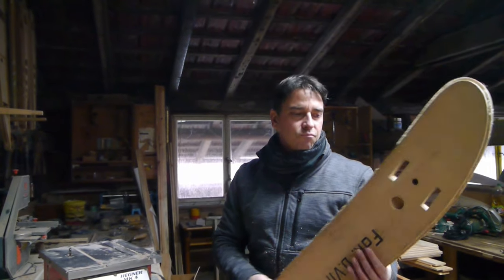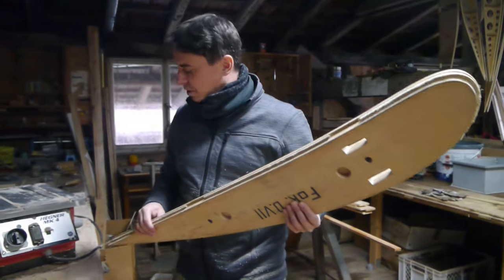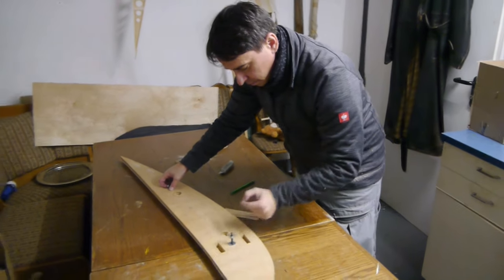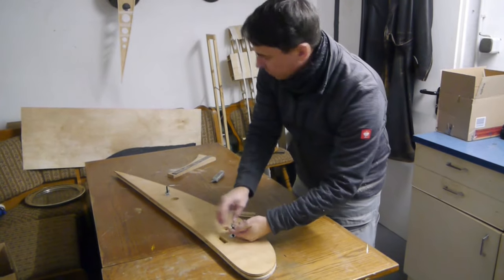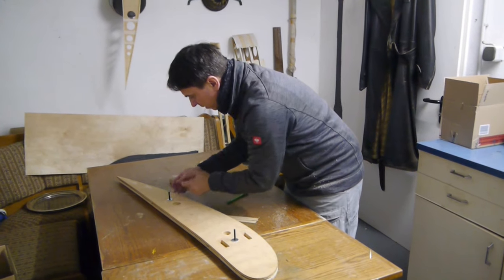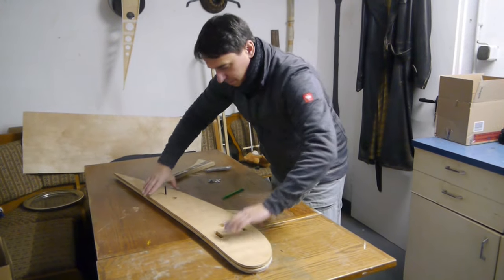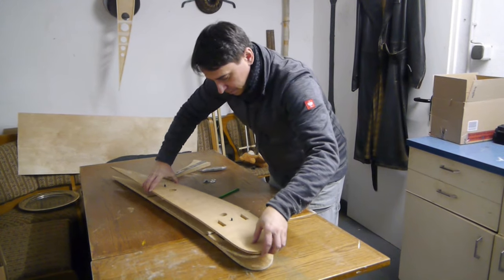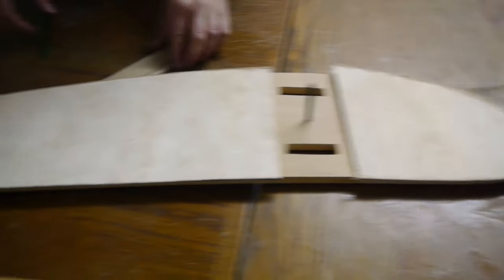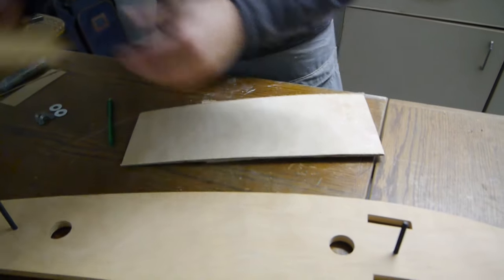Steffen, how do you like the method of rib routing this way? Simple and effective, isn't it? The templates work well, and if you treat them with care they will last a while. I really have to be careful with the bandsaw. Be careful, otherwise you'll have to make me a new template — this one is now about 15 years old. I don't want to be the one who breaks it. And here we have the finished routed rib webs. They can be taken out of the form now and be slightly sanded. Done with the first step.